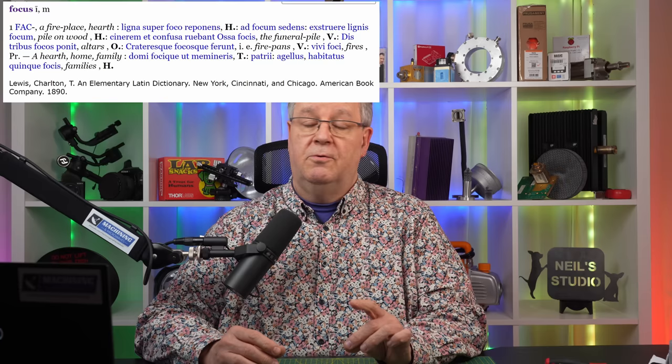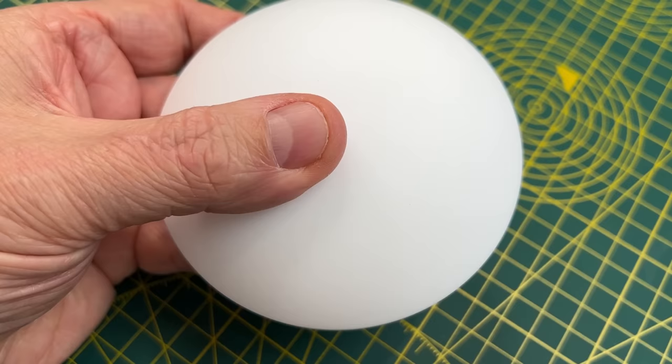If you put a magnifying glass in front of a piece of paper in bright sunshine, the rays from the sun are almost parallel so they all focus down to a point, and most of the power of the sunlight hitting the lens gets concentrated into a small spot at the focus — quite hot enough to set fire to the paper, as I found out very often as a child. Fun fact: 'focus' is the Latin word for a hearth or fireplace. Now because light and radio waves really are the same thing, a very distant microwave radio signal also appears as parallel rays, and if we can make a lens from material that's transparent to radio waves like Teflon or polythene, it'll focus the power of the radio waves onto a small spot. However, a lens needs to be at least 10 times the wavelength of the radio waves — preferably much larger — or it won't be able to focus very sharply.